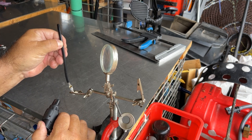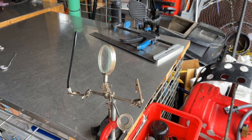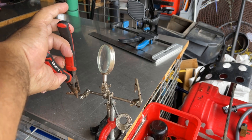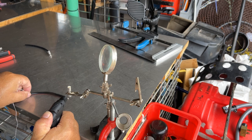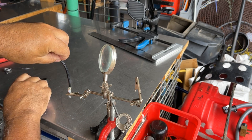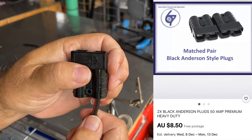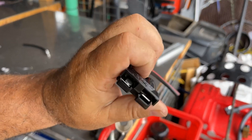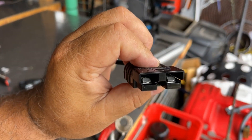I've decided to go with 50 amp Anderson connections for this build — this is my preference, may not be yours. For the trolley motor it will be red Anderson plugs, and for the power it will be black 50 amp Anderson plugs. So when I'm connecting them it'll be easy — red on red, black on black, and happy days. The upside to this connection is if the PWM fails while I'm out on the water, I can just disconnect the PWM and connect the motor straight to the battery. I'm going to let this build play out and I'll come back to you all later.